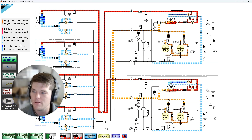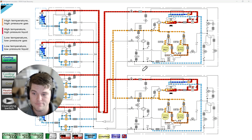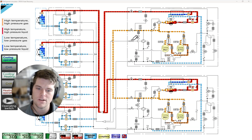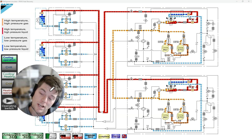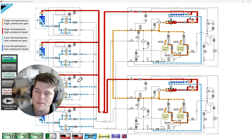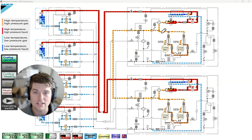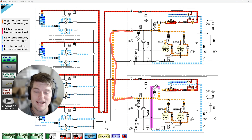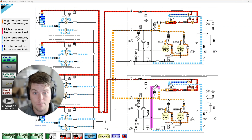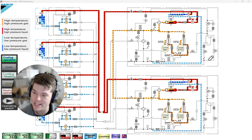We can see two pipes clearly labeled: red up here is liquid, and the other one is hot gas. Heat recovery has a hot gas line and a liquid line. In VRV3, we have what we call an equalizer pipe. That equalizer pipe is designed to share hot gas between the modules, and you'll notice there's no four-way valve here, so this line is dedicated hot gas.